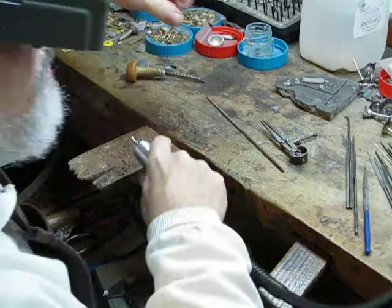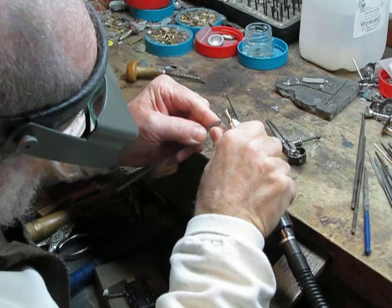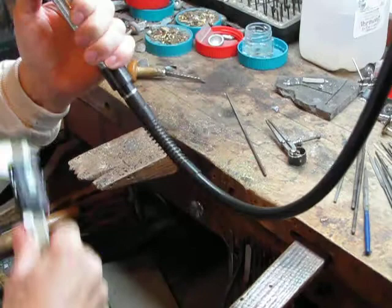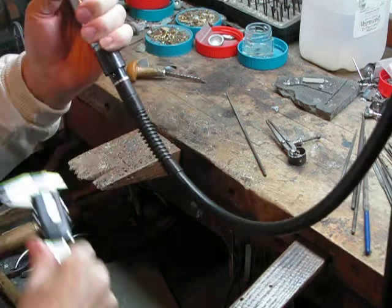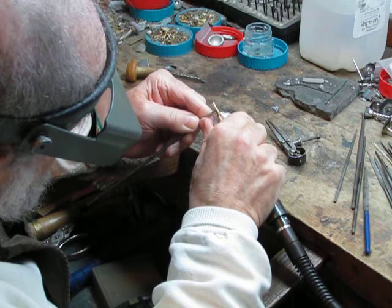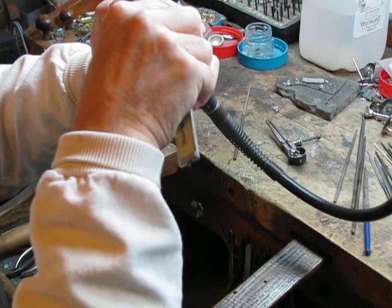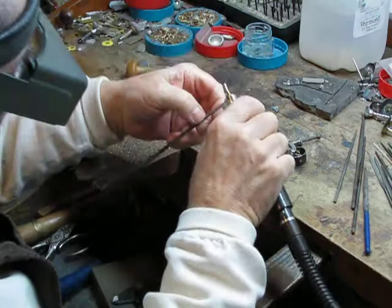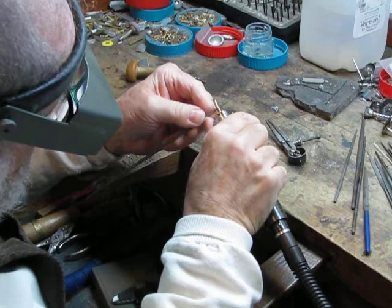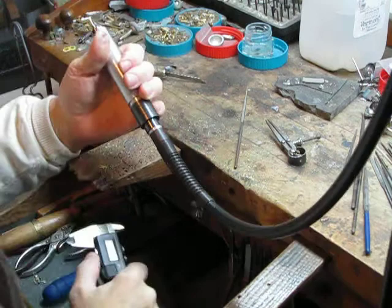So I'm down to 63 thousandths of an inch. Pretty soon the peg will be ready. Thousandths of an inch. This diameter matters because it's the diameter of the drill bit I want to use to drill the hole to place this into the airship. Just about there. Here we go. 60 thousandths of an inch.